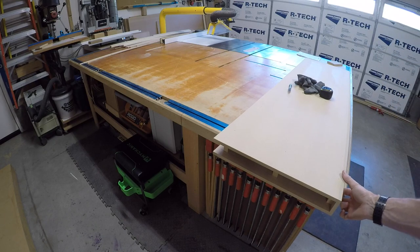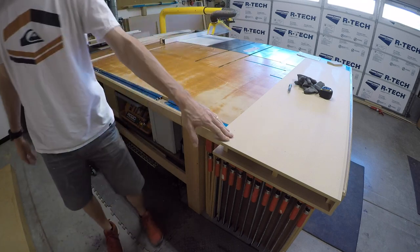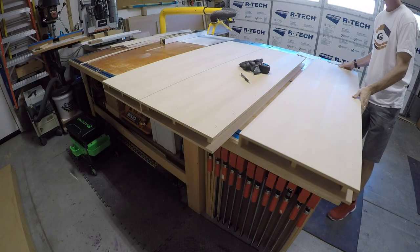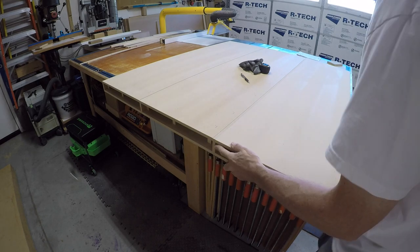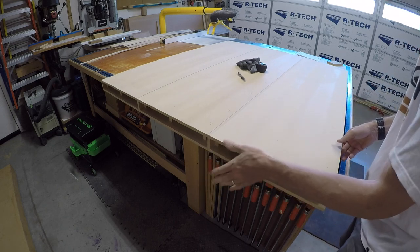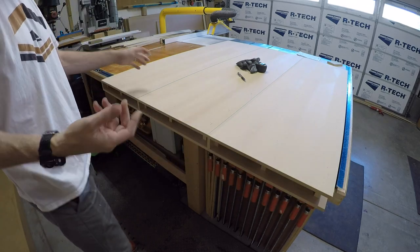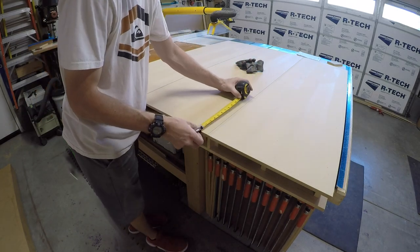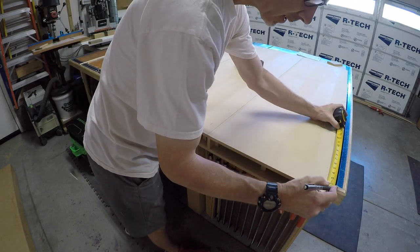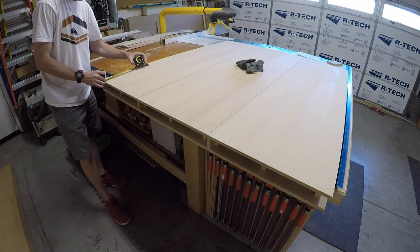I'm going to use my track saw. So that's going to be interesting. But here's the thing, because I'm going to do three up, because I have a 70-inch fence, I'm trying to yield the best cut on the face, even though these things might be getting trimmed. All right, so I got these things somewhat flushed out, even on all the sides. So I'm going to be taking off about 1/4 inch off this guy, and I'm going to go ahead and just measure that out and put it on this one here. That's going to be about 1/4 inch. Go down on this one.